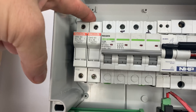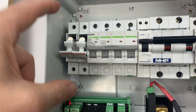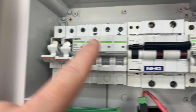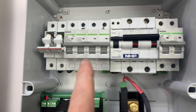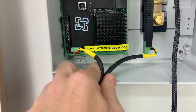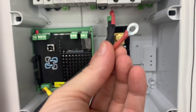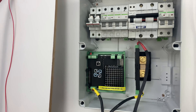And then I've got the fuses for the Batrium and the fans. I'm probably only going to fuse one leg rather than two, and use one for fans and one for the Batrium. I will soon get an email telling me that's not the correct way to do it, and if that's the case I do have a little bit more space there — I can put another one, and I do have another one laying around somewhere. So that will come from the power there. I've got the shunt wire there that I'll trim up and make nice and clean and tidy. I've got the positive sense cable here which will go up into here. So obviously that'll be shorter. I think that's going to work — what do you reckon?